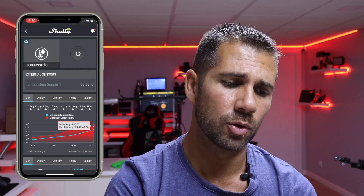One of the main differences with the Shelly 1pm is that with only one device I can get both the temperature and the power consumption. If I turn on the power right here on the Shelly 1pm, we can see the current consumption is at 370 watts — and that's because I've got a power limiter. My electric resistance is 3000 watts, but with the power limiter I can set it to 600, 500, or 1000 watts.